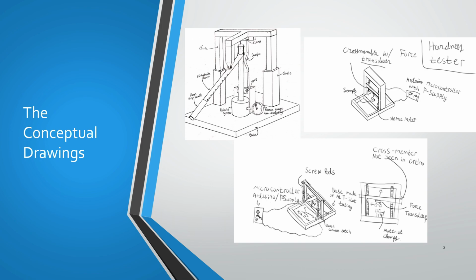So this compact design is cool in that we get a universal load cell that can be used in compression and tension. For those that don't understand how that works or why that's significant, we're able to put two materials testing pieces of equipment into one. The materials lab testing things that we're considering are the hardness tester and the tensile tester. The tensile tester operates in tension, while the hardness tester, known as Rockwell hardness testing, is used in compression. So the stepper motors would drive down and create compression, and that would be useful for the HRB tests.